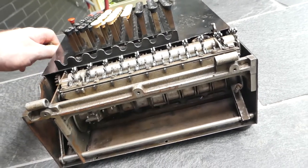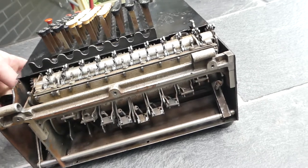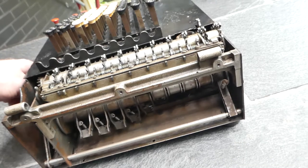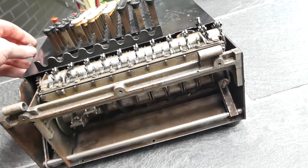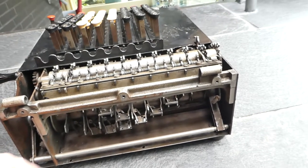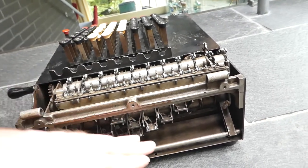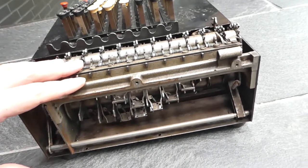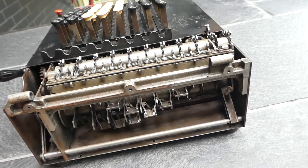On this side you have two spirals, but at a certain point they cross and after that there's only one spiral left, and all these parts move. During subtraction part of the spiral goes that way, and during addition they go up this way. If I turn it the other way you'll see that they start shifting up until they're in position to spiral the opposite way. In the later models they managed to put these pins slightly closer together so they didn't take up as much room on the axle and didn't cross anymore, and they also changed the timing so that this whole problem disappeared. This rather complicated but clever solution was no longer necessary.